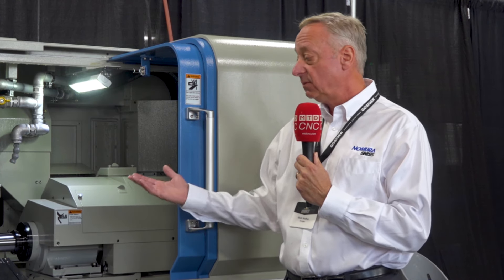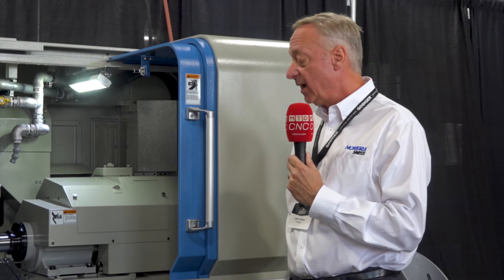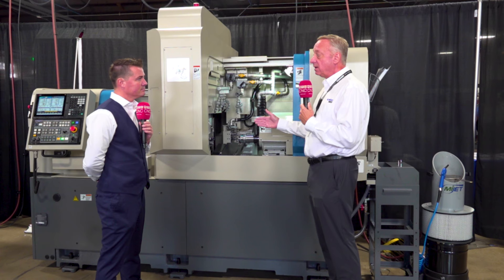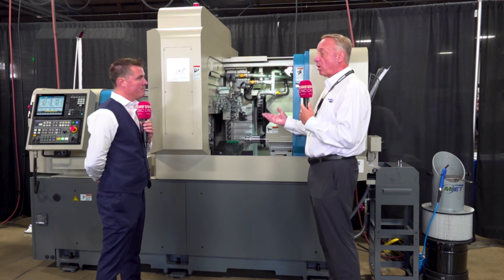It's a good advantage. Also with this base casting, it's a lot of iron, a lot of good footprint on the ground, and we have a dovetail head scraped way on the main axis — so it's a very strong platform. That enables us to have finer finishes, longer tool life, and really helps us avoid a secondary operation for grinding and less interruption to change tools. So all of it equals more parts.